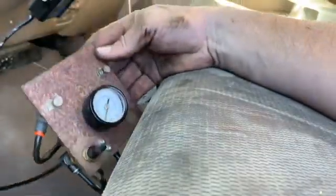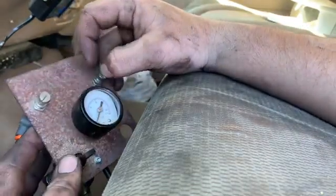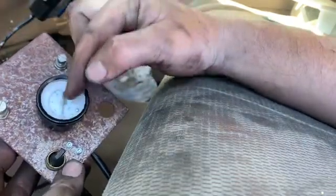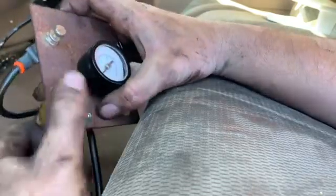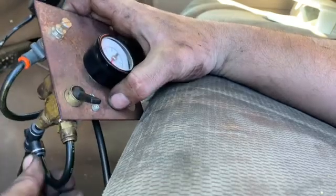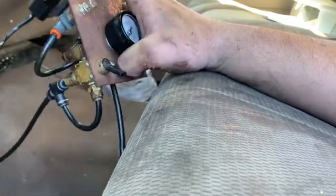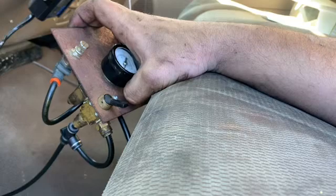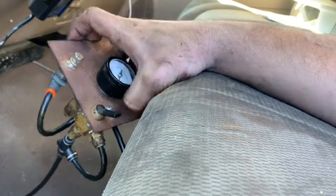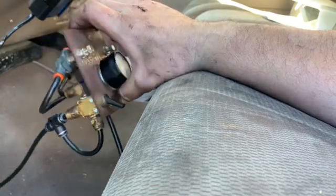All right, so now we are ready to make some adjustments. We have the needle valve, which is fed first and controls the rate at which the air is moving, then the pressure valve to determine how much pressure is actually getting to the AFC, and then the valet switch. This would be run mode, this would be valet, and this would be balls to the wall. We'll see if this made any difference — I'm hoping the new spring is going to give me a little more fuel. Thanks for watching, and hopefully I can get a video of seeing how it performs.